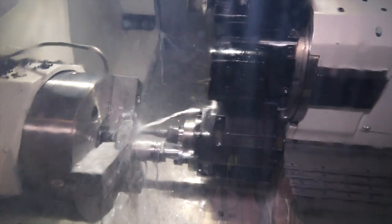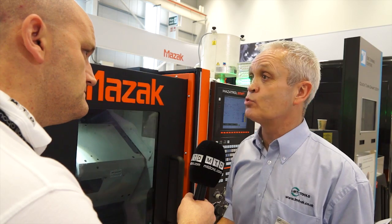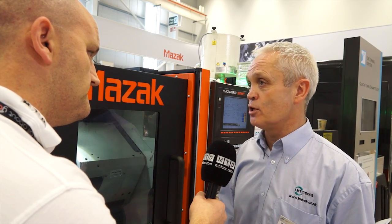What makes that different? Why would I do that? Is it purely down to cost? Not necessarily cost. It's also because it's a fluteless tap, there are no swarf issues. A lot of times you get an automatic process with a tangle up of swarf. This is a fluteless operation and there's no swarf.